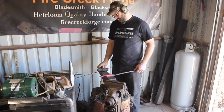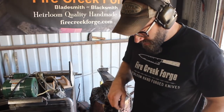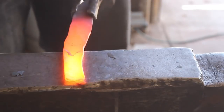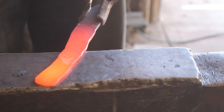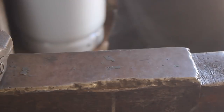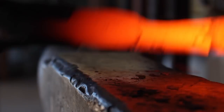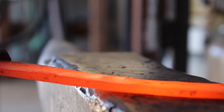I'm kind of guessing as to how big of a knife I can make — my goal is to make the biggest knife possible out of this steel. In hindsight I could have gone a little bigger. An inch and a half ball bearing is a deceptively large amount of steel compared to what you might think. The knife I ended up with is a decent size. I could have tapered the tang down a little more, but I got pretty close to using all the material efficiently. Here I'm forging out the tang, flattening it and putting some slight curves in it for comfortable use.